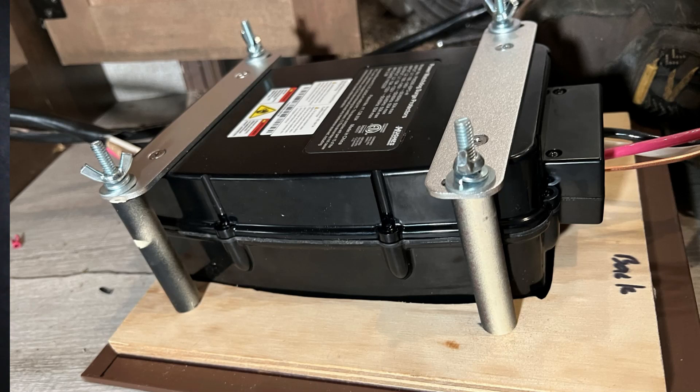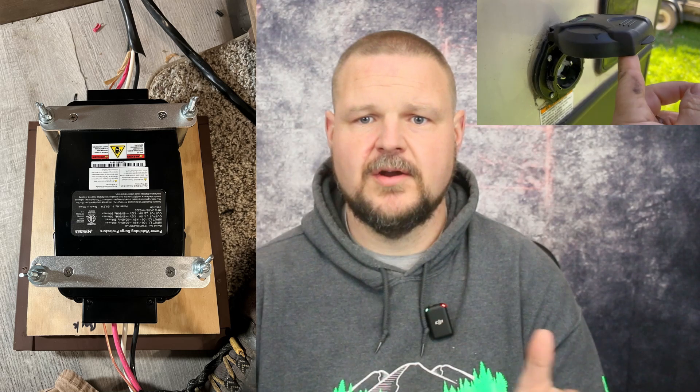The install was going great until we got to the wiring. I wired everything up just like the directions showed in the picture — input on the top of the unit with a new piece of wire going from the power inlet, and output at the bottom going directly into the transfer switch I'd previously installed. In most setups that would go straight into your distribution center. After I made these connections and turned the generator on, it didn't work — nothing happened, no power, no light on the front. I read that there can be an issue with an open ground, so I made a bonding plug to try to fix it. Didn't work.